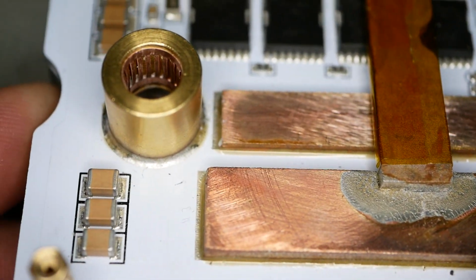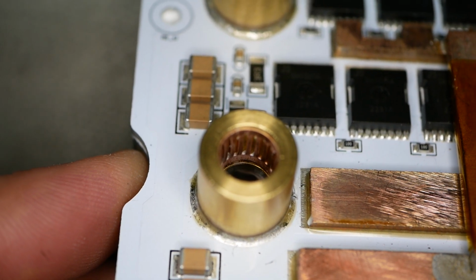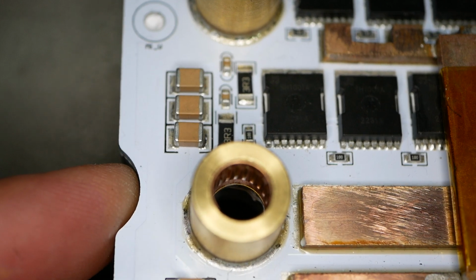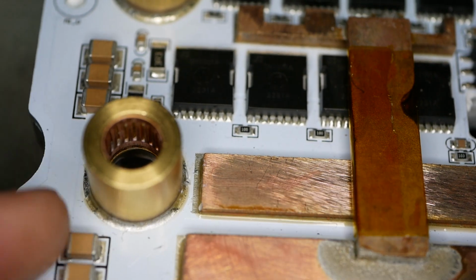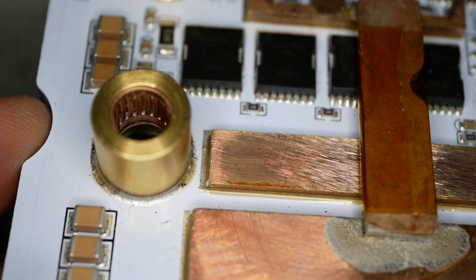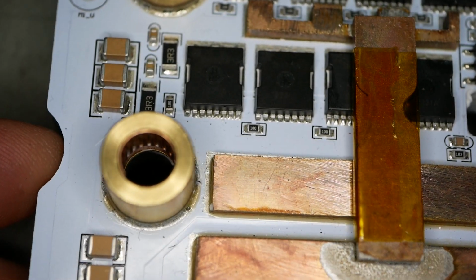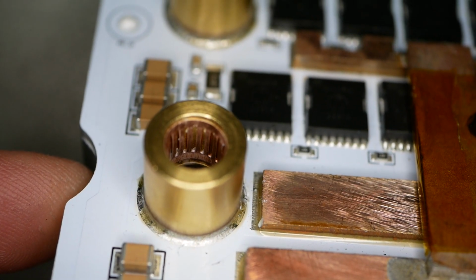All right, so the other one is this over here, and you can still see white residue behind the fingers. What I discovered once I started cleaning that one out was that that was thermal paste down there. In fact, if you look in the bottom of the hole, you can still see thermal paste underneath there. So basically, it oozed out from between the MCPCB and the aluminum heat spreader underneath it, and partially polluted that hole. And then when they pushed the two together, they never bothered to clean out the extra thermal paste, which then polluted the connection. So anyway, I tried alcohol first.